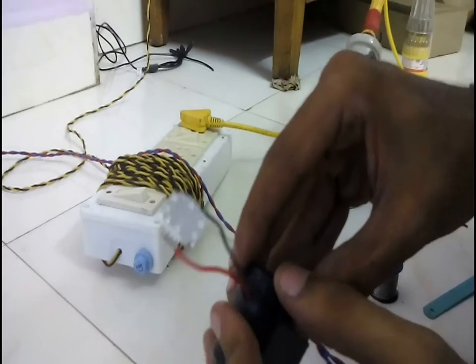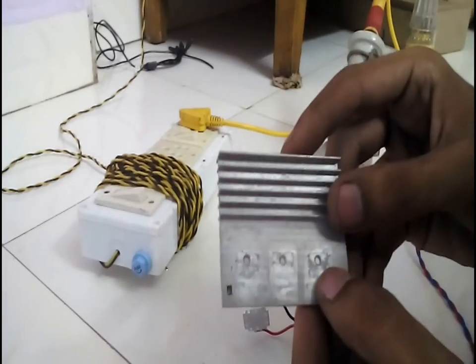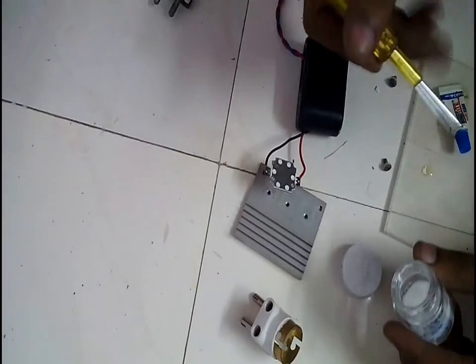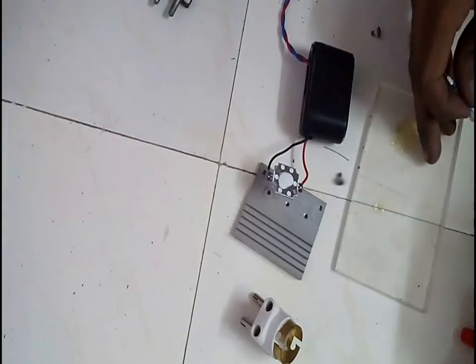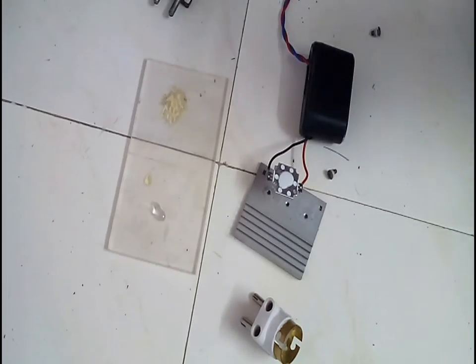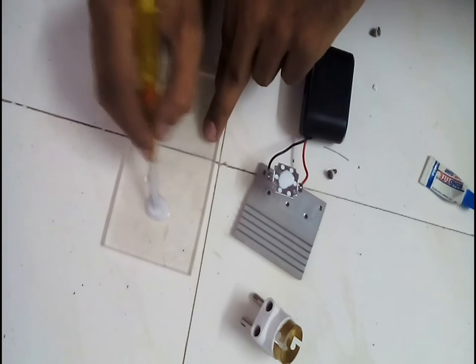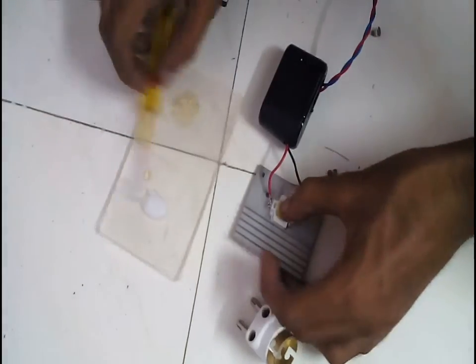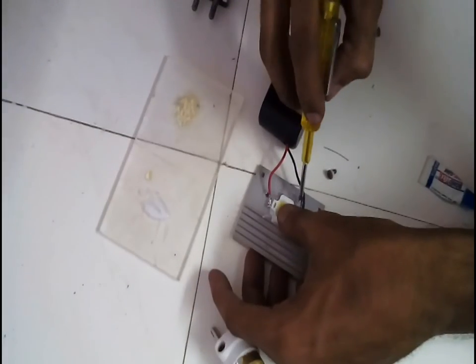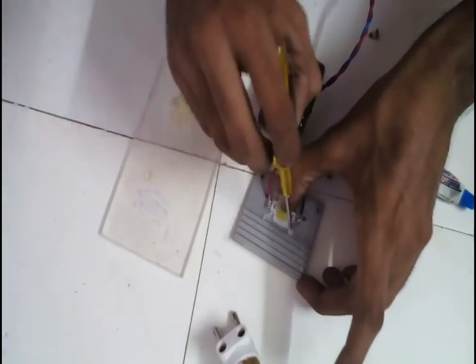Now the light is ready; the only part left is the heat sink. You can use any metal piece as a heat sink. First, we will apply a small amount of heat sink compound over the LED. We will use a 2-part epoxy which can handle high temperatures to stick the LED onto the heat sink. I will apply the epoxy only at the corners of the LED such that there is no air gap between the LED and the heat sink. Let the epoxy dry for a couple of hours depending on the setting time.